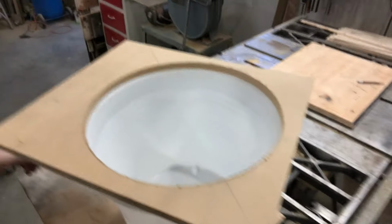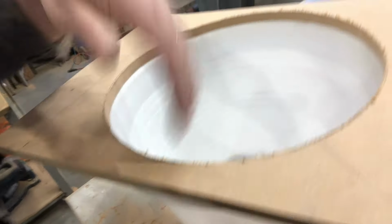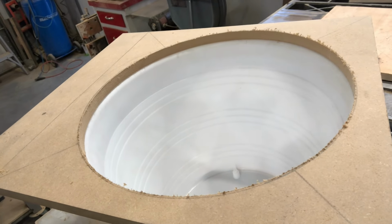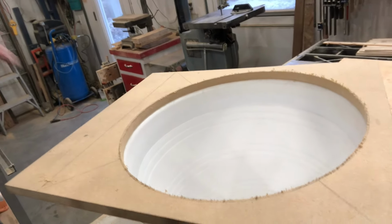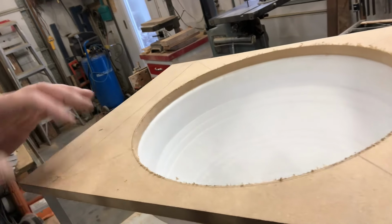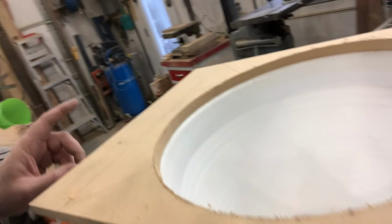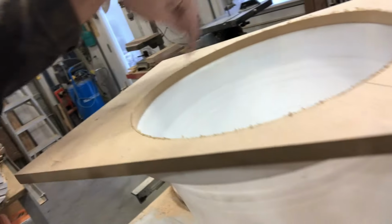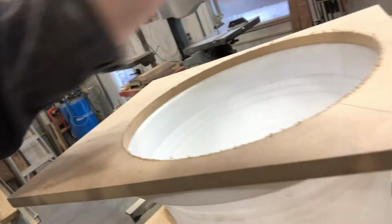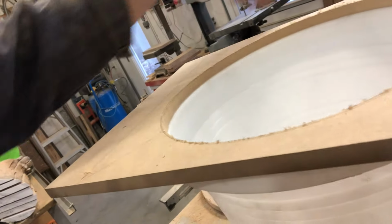Off the tether. And now you can see how the hat is going to sit. So the bottom of the hat will sit like so, and that leads very nicely into our cyclone. So I'm not going to cut the top part yet, but I will put on the sides on this at least loosely, because I want to now work with our little bit of green plastic to make the inside guide here. As the air comes in here, I don't want it to be bouncing around in a square chamber, so that green plastic will go all around here to make a nice guide for the air to flow.